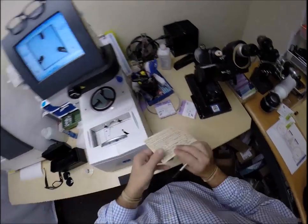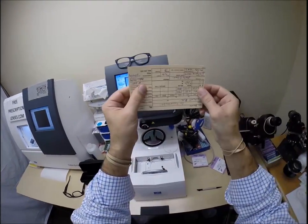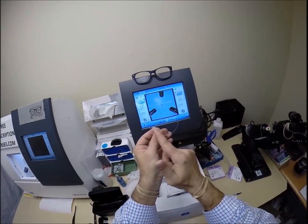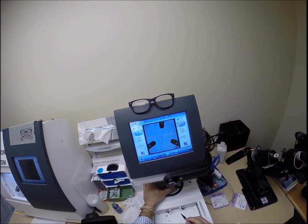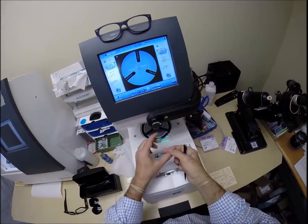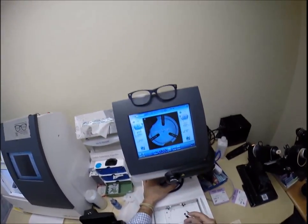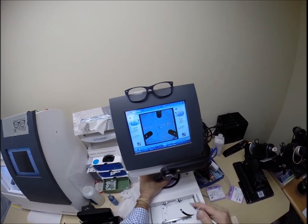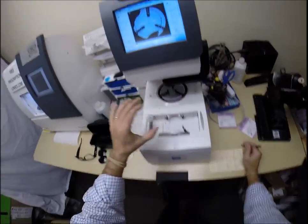Here's one of those great things — a straight line: zero to 90 to 180. Your prescription is the same whether it's mounted this way or that way, because it's such low-powered. When I was reading it in the lensometer, it's actually de-centered a little bit, so I can rotate it and get the same prescription when it's upside down like that. It just gives me a little bit more room to work with — a little more lip. So I'm going to rotate it around, buying myself a few extra millimeters, known as the fudge factor. Hit that button — the arm comes down and places the block onto the left lens.